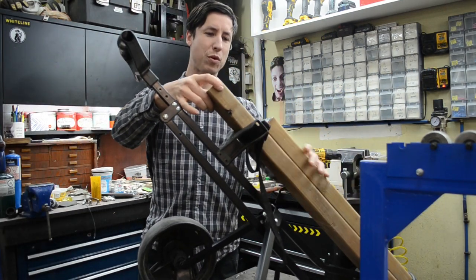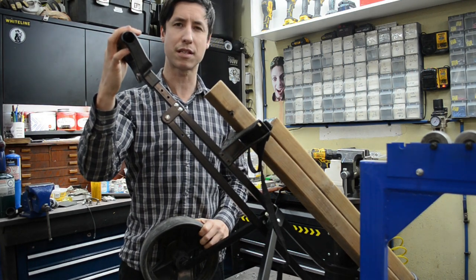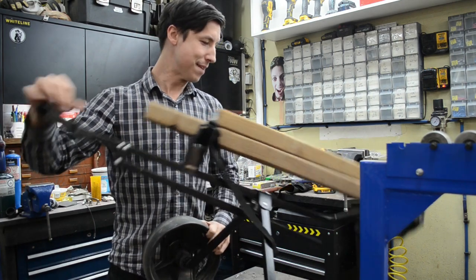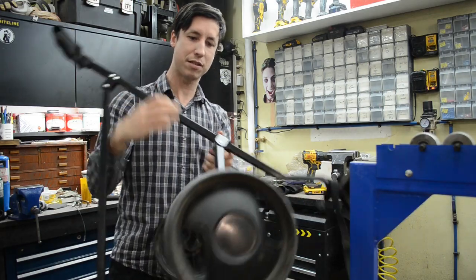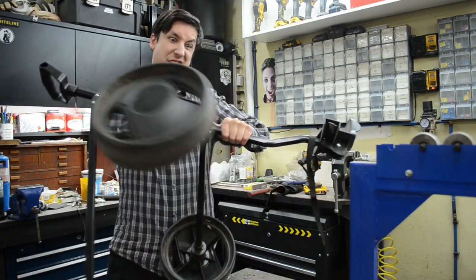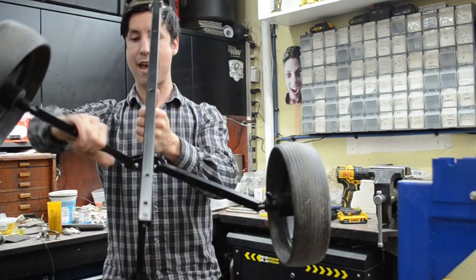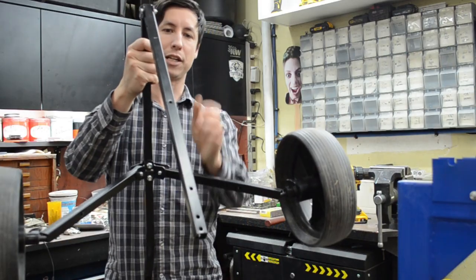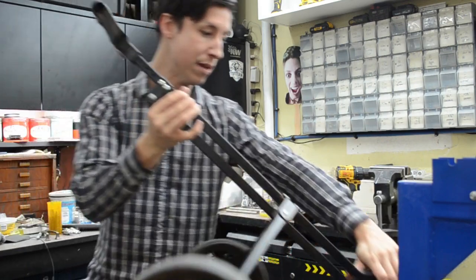The bag is about 27 inches in height and roughly 3.6 kilograms. The weight is taking an awful lot of force to hold it here, so we've got to try to adjust the balance point. If I just shift this down, it's going to pull these wheels forward and they won't be straight. I have to make sure that everything moves evenly to keep everything tracking true.